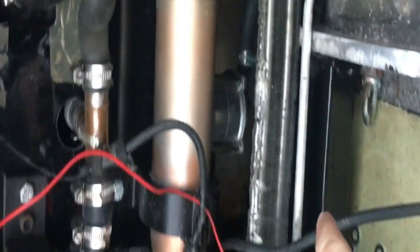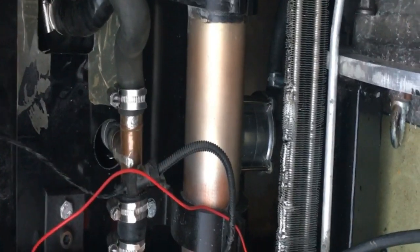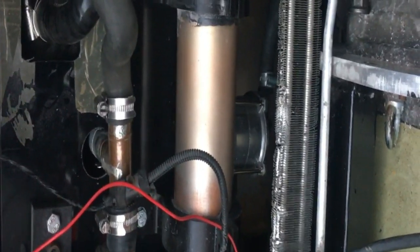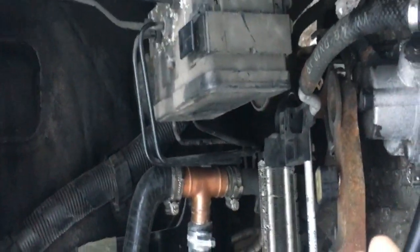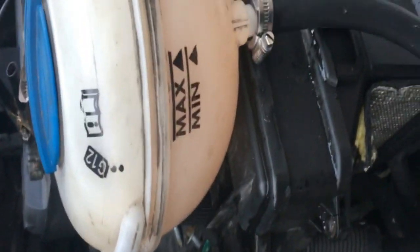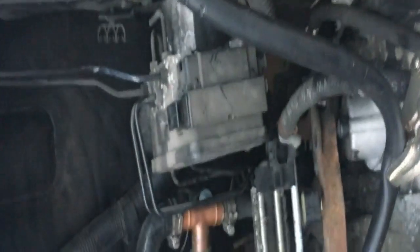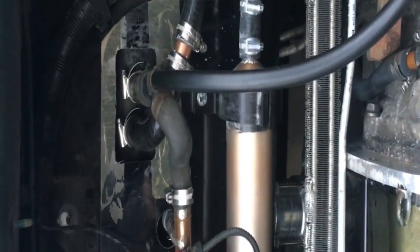At the moment I'm using a mains heater — that shiny thing down there — that is heating up the vehicle nicely. I've got a pump running as well to throw hot water down these pipes. I need to put a restriction in the pipe going up to the expansion tank because it was just siphoning around, making that very hot while everything else was not getting the benefit.